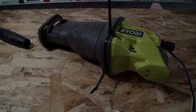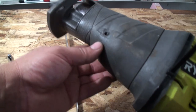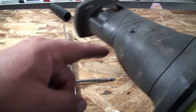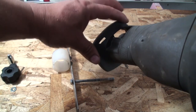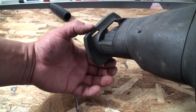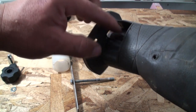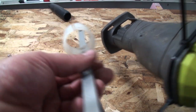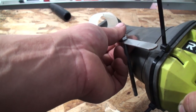Another modification I had to make, other than punching a hole through here to mount my anti-torsion bar, is a slot for the bar to go through so it doesn't interfere with this rubber piece. Otherwise, without that slot, the bar will push on the rubber and push it into the drill housing and it'll start to overheat. So this bar basically goes right through there and continues on to where it needs to fasten.